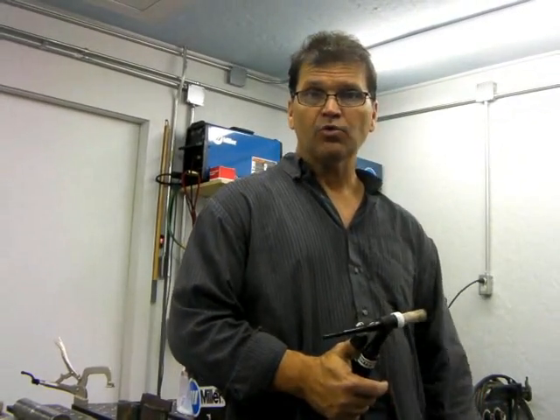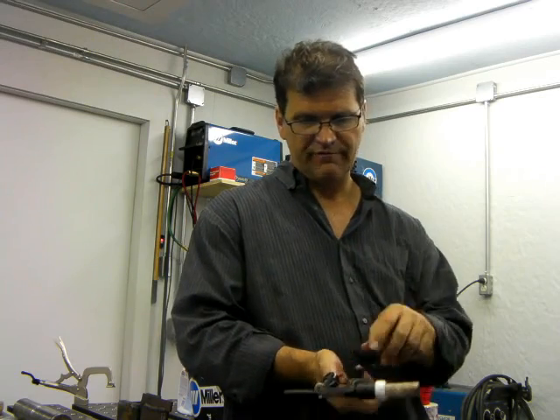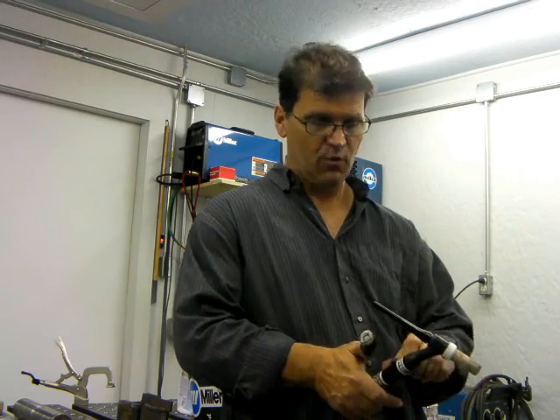Today we're going old school, and I really mean old school. I horse traded years ago for a rectifier that you could hook a buzz box AC welder up to and get DC current out of. When you've got DC current, if you've got a DC stick welder, you can do some crude TIG welding. A whole lot of TIG welding, even today, is done with just a DC current power source and a scratch start TIG torch, usually with a valve on it so you can cut the argon on and off when you want.